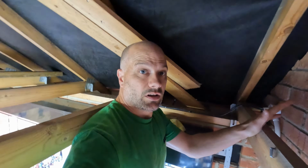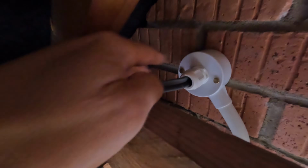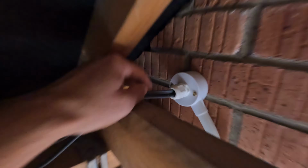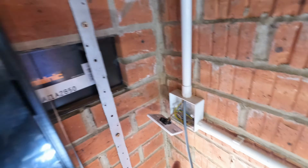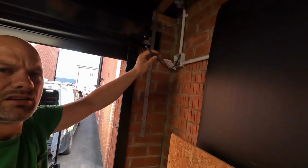Let's go. So there's not really enough space up here to show you what I was doing, so I didn't. But as you can see, we've brought that down through the conduit. We've got a cable here, but yeah, it comes up through that stuffing gland. And we've got a little bit of slack just to put a clip here, and it goes down to the camera. So that's going to be our point of isolation, and yeah, we'll start connecting the dangerous end.